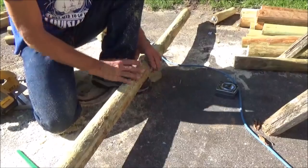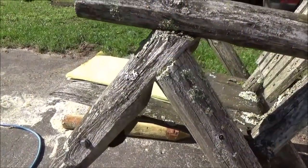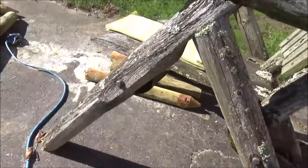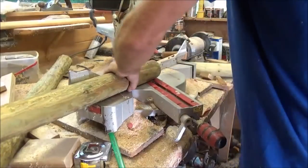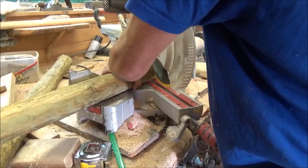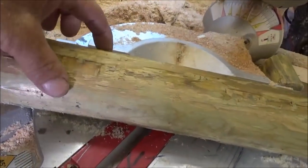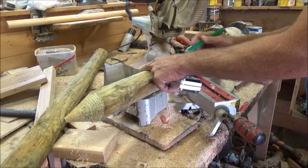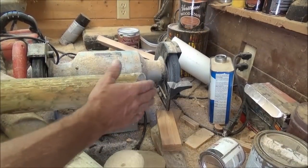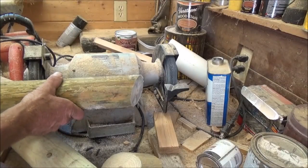Since this is seven foot long, I'm going to cut this in half — it's going to burn up a whole log anyway, and it'll be easier to handle inside the workshop. Before we cut these, we're cutting this right here — it's a 30 degree angle. That's a 30 degree angle long to short; this is long point, and when I get down here we're going to cut it like this — that'll be short point. I'll measure that over to 28 inches. Before you cut that second cut, look at your angle here. Make sure you get it as square as you can; otherwise this one will be cockeyed. It doesn't have to be perfect, but you want it to be pretty close.